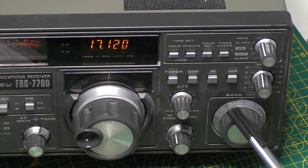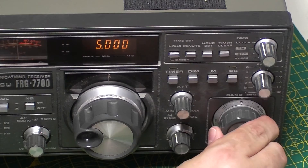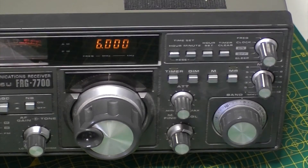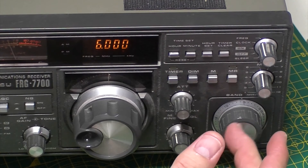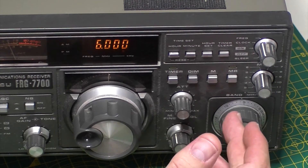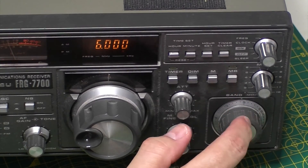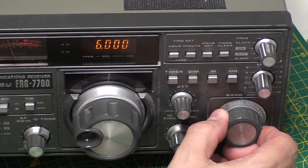And again — 6 MHz. What's happening with this? It seems to be switching up to about 17 MHz and then settling back down to the frequency that it's on. It could be that this control is dirty — that's going to be my first attack. But it's possible there are some capacitors that are not working correctly in there. Also there are a couple of transistors and an IC in this circuit that could be dodgy.